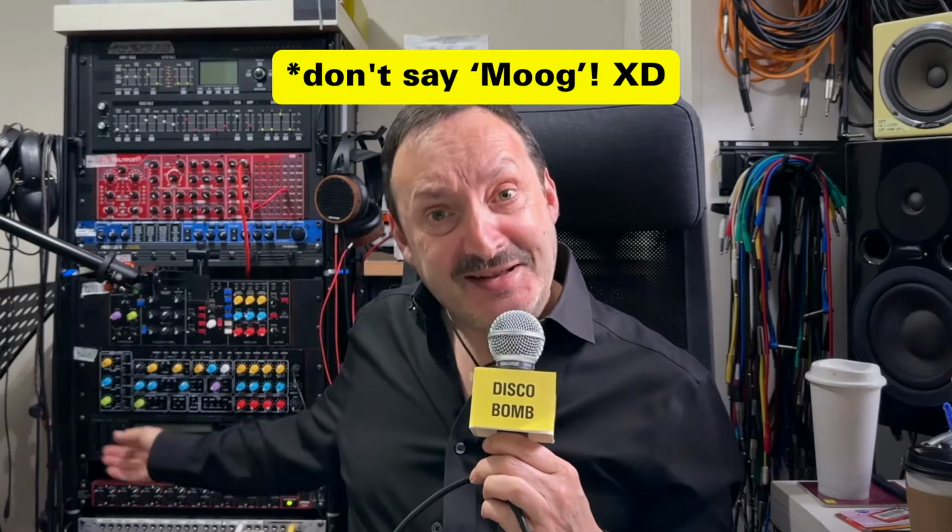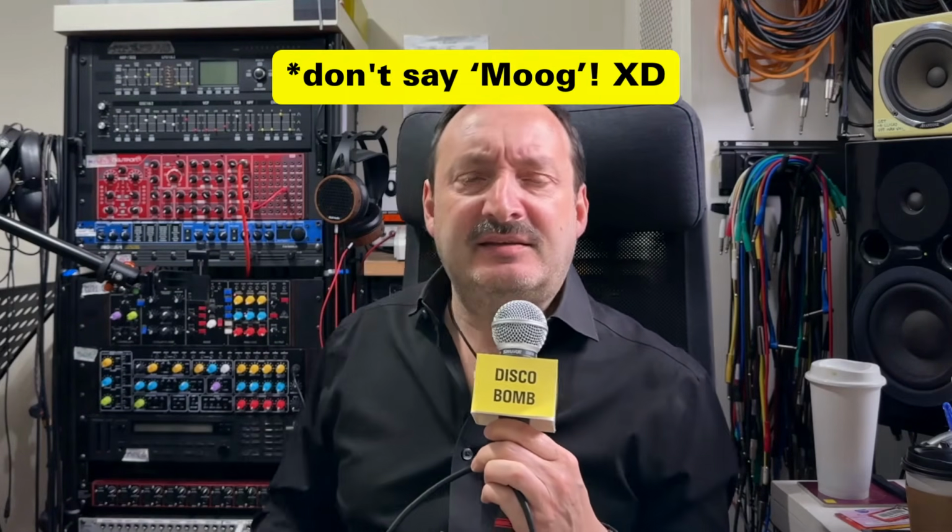The Pro 1, of course, has the Curtis filter, which is what's called a two-pole filter. So that's a 12 dB drop every octave. I was going to say Moog, shouldn't say Moog, should I? The Model D, the Behringer, maybe the Moog Model D, has the famous ladder filter, 4-pole, steeper slope. It's not as simple as that. I've got other analog synths with a 4-pole filter, and they don't sound like that. And for what it's worth, I've got other analog synths with a 2-pole filter, and they don't all sound like the Curtis filter. So don't be fooled. It's not just about the filter slope. It's about the quality of the filter and what sound it makes when you push into them.